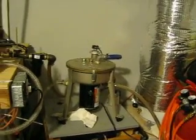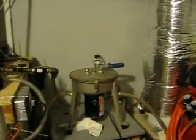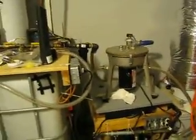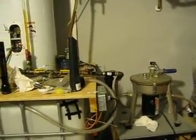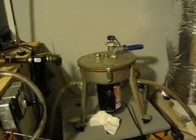It's just kind of hands off. I fill up my water heater here and then gravity feed it down into the centrifuge at about 8 gallons an hour or so. This tote down here catches it, and then from here I use the pump down there to pull it out of the tote and pump it into my truck. I don't even bother testing the oil for water anymore because it's going to pull out any water that's in the oil, any chunks and crap that would have passed through a filter or filter bag — all that stuff gets stuck to the walls of the centrifuge.